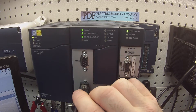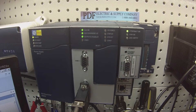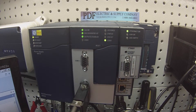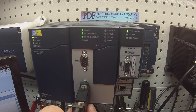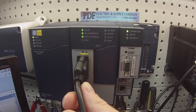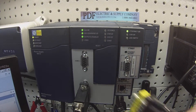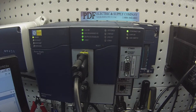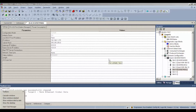The other thing is we've got to test COM port number one. In order to do that using the CBL232, we're going to need a gender adapter — a nine-pin male. I'm going to disengage my connector and go with this nine-pin male, associate it properly, and it should go right on. We want to see activity on COM port number one. We connect up to it, the software needs to see that it's connected, and we have activity on the port — and that's what we want.